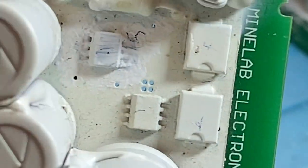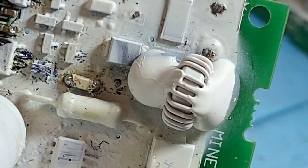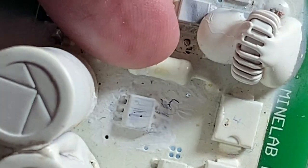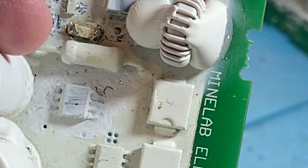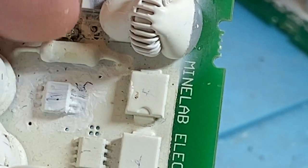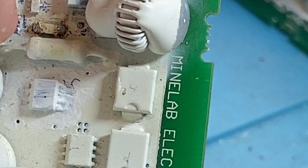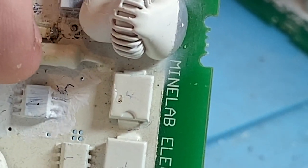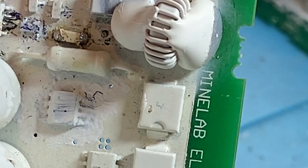That reminds me of another thing, the damping resistor. The damping resistor is right near some filter capacitors for the 15 volt rails, negative 15 volts. These things switch negative, by the way. And that can go open circuit, not likely, but it can.